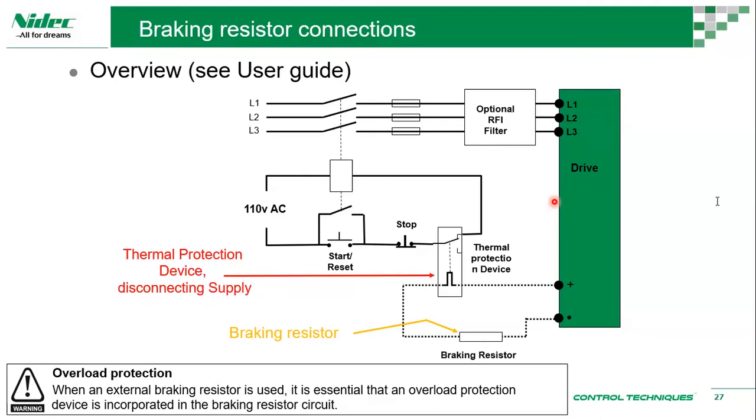So when we talk about standards, we really need to go and look at the standard. What does it cover? What scope does it cover? Most of the time, the standards that go for switchgear and controlgear would not apply for VFDs. It's a different game, a different standard, because switchgear is more like just switching, and there will be standards for noise, mechanical requirements and so on. VFDs are not a mechanical switch in a way. Sometimes these standards for low voltage switchgear and controlgear assemblies may apply to soft starters, but we really need to look at it. Most of the time, it would not apply for VFD.